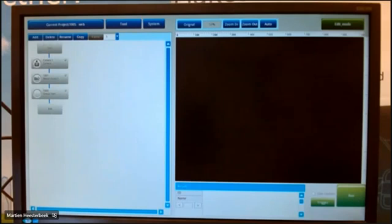When you have a new program, it will always start with this flowchart. That means we have a camera. If you have connected only one camera, we have only one flowchart. If you have connected 2, 3, or 4, then we have more flowcharts here, and each camera can have its own flowchart. You cannot mix the flowcharts. You cannot switch from one to another in that case. What you can add, of course, are function blocks inside of the firmware, and we can add more than one function block in one flowchart. You can add 5, 6, 10, depending on what you want to do, of course. The more function blocks you add, the slower the system will be at the end, of course.